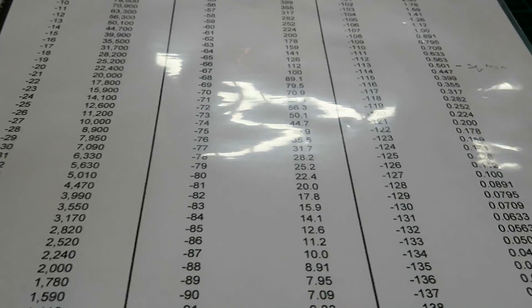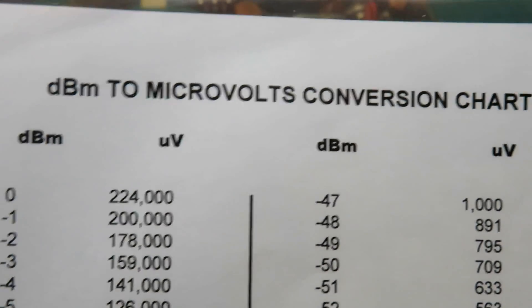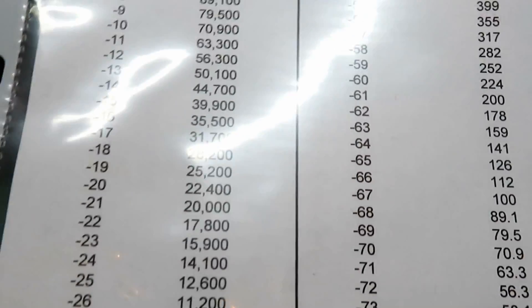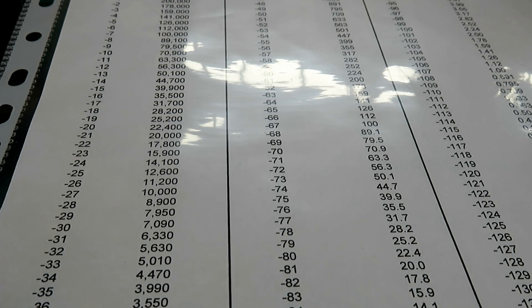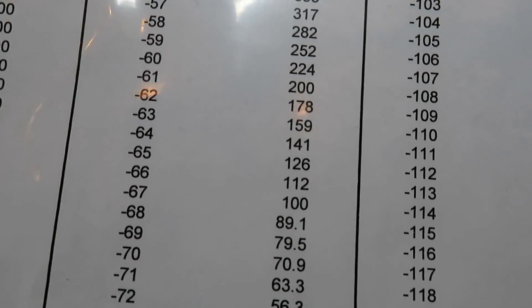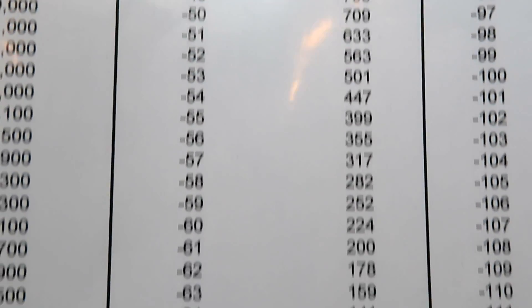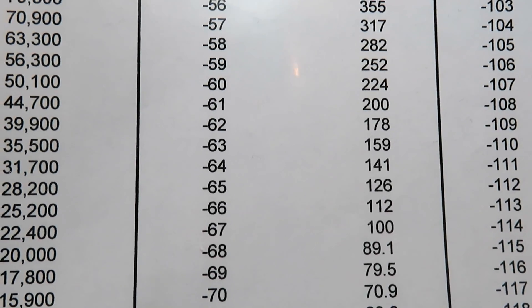If you watch a lot of my videos or Rich's videos, you'll be more used to microvolts in terms of signals. So this is a really good chart to download - you can get it online. It's a microvolts-to-dBm conversion chart for 50-ohm systems, and you can use this with your TinySA to work out your microvolt conversion. For setting the detector we want to set a 100 microvolt signal into the radio - on this chart you can see 100 microvolts is minus 67 dBm.